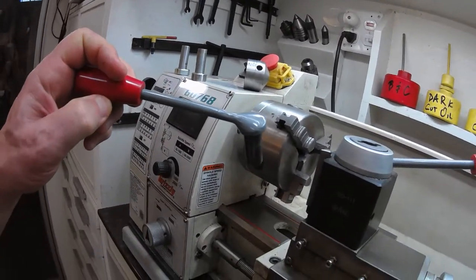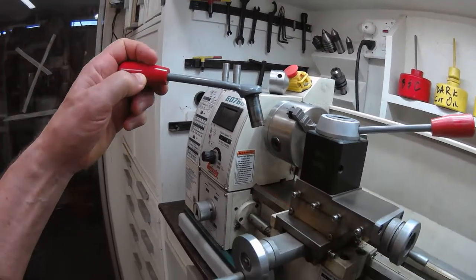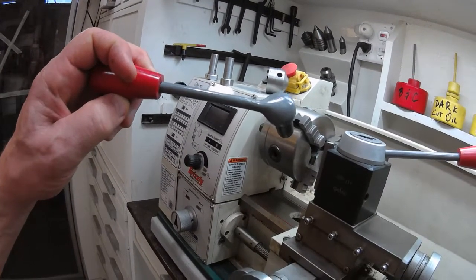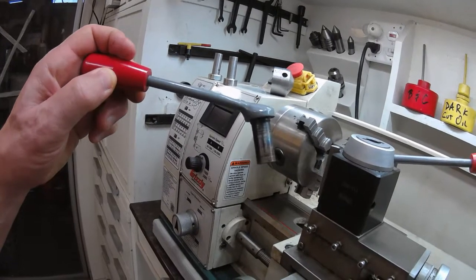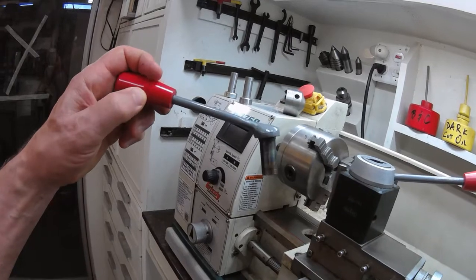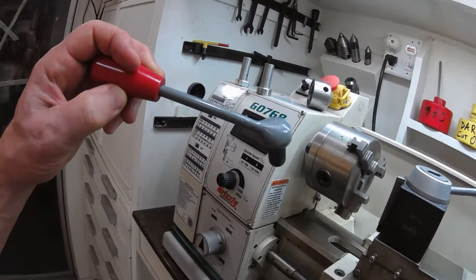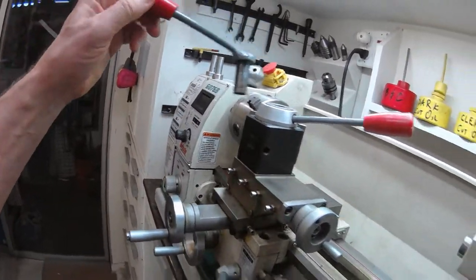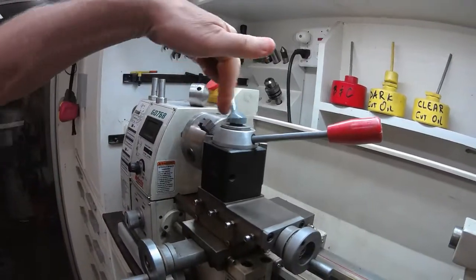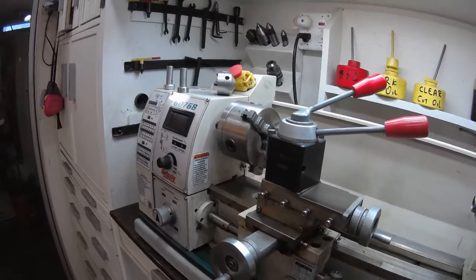So rather than using a large piece of metal with a cylindrical nut, I took another cylindrical nut, ground off a flat on one side, put it in a vise and then drilled it. I don't have my mill yet. Essentially what I have is a round bolt — it could have been a hex bolt but this was rounded — drilled, then welded in, and used some JB Weld to smooth it out, painted it so it doesn't look too bad.